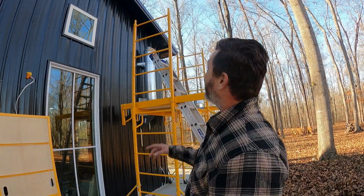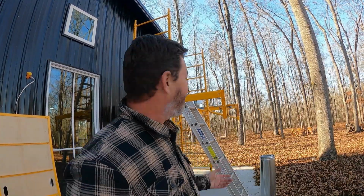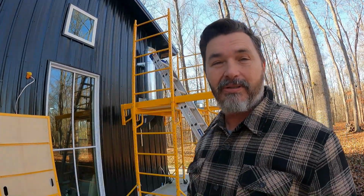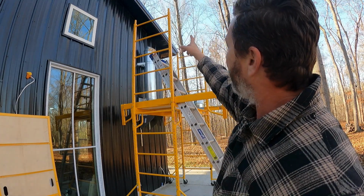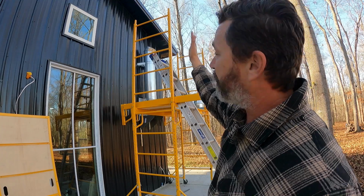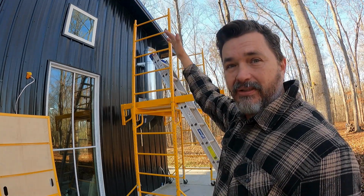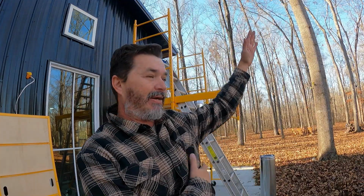All right, so I just took the 36-inch piece off. I bought 3 of these 36 inchers. I really should have bought 2 36 inchers and 1 24-incher. If I get the 24, I believe it's going to land right where it needs to, before where I can angle up, and it will be much closer in to the soffit there for bracketing, and it'll have less weight coming out off of the house.